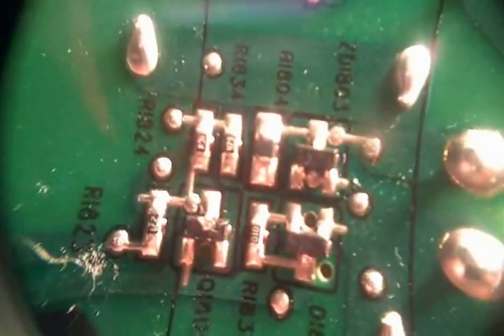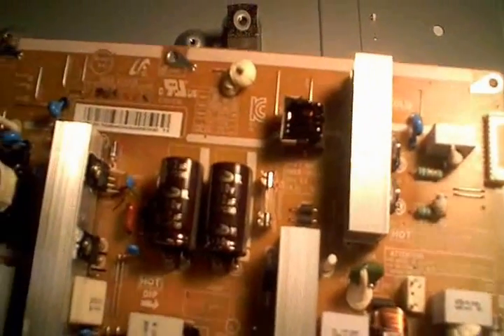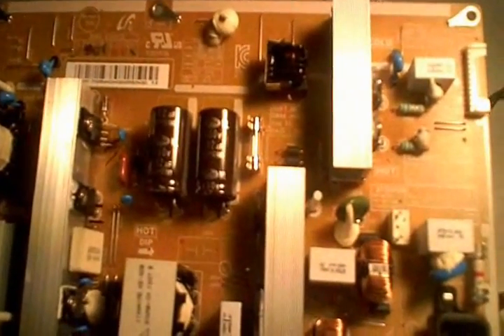Each transistor appeared to have a set of driver transistors underneath. I found what appeared to be a zener diode and a couple other components that checked kind of weird on my resistance test. Anyway, when I saw the board for sale on eBay for about 50 bucks I figured, well great, that'll be a quick solution to get the TV back to my customer real quick.